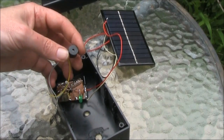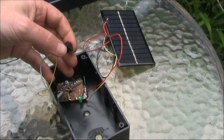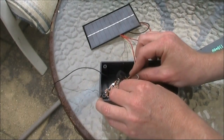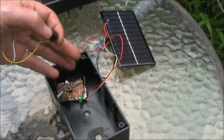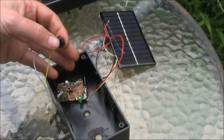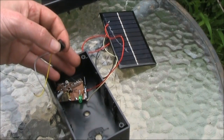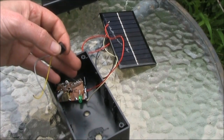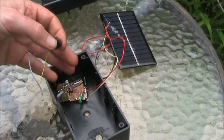See if you can use a piezo buzzer in conjunction with the flashing LED and the transmitter. If you have the buzzer in the right part of the circuit, you might be able to modulate it. That's beneficial, because at the moment the pulsing CW can only be properly heard on a CW or SSB receiver. If you add some modulation — putting the buzzer somewhere in the circuit will give you both frequency pulling for FM and amplitude variations for AM — then you should be able to hear it on almost any type of receiver, even possibly a homebrew super regenerative. That makes the beacon much more versatile and easier to track with a wide variety of receivers.